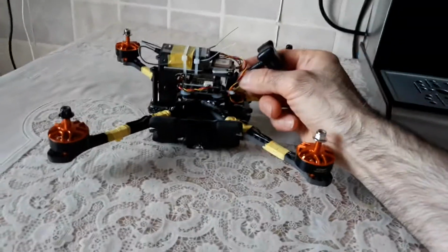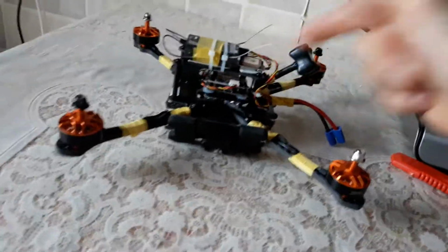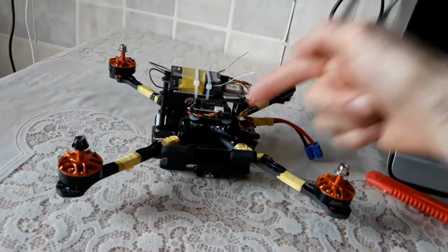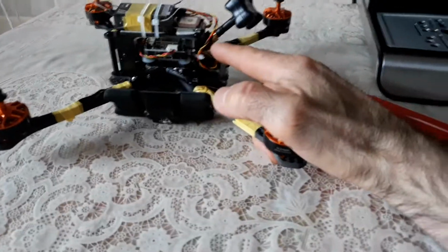As you notice, on the antenna there is no screw, the usual extension screw. Remove it, otherwise it won't sit properly and will not connect the antenna. Even if you believe it's connected, the pins will not sit all the way down, and basically it will fry the VTX. Make sure you sit it properly.